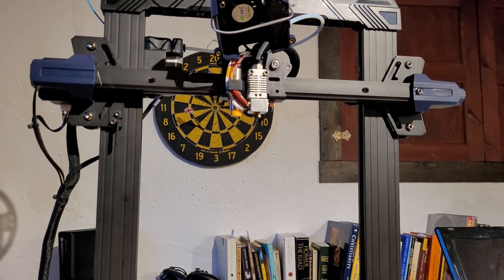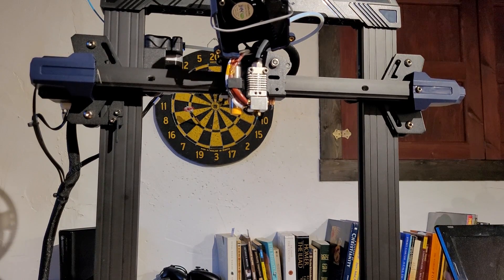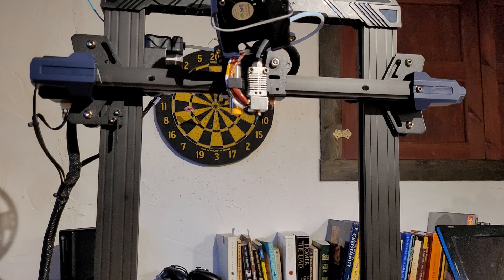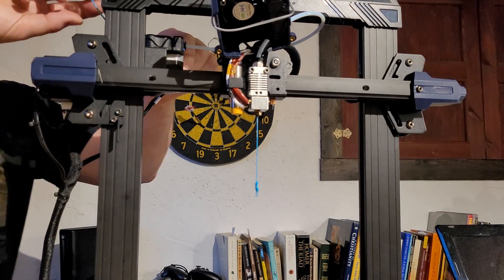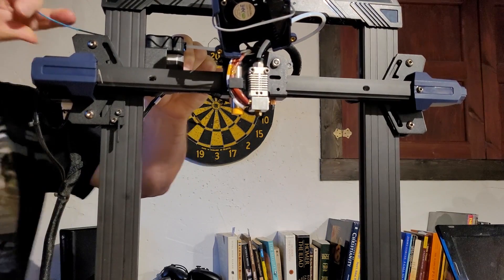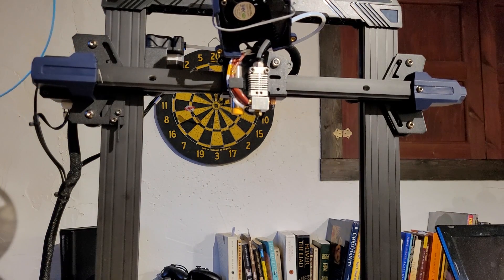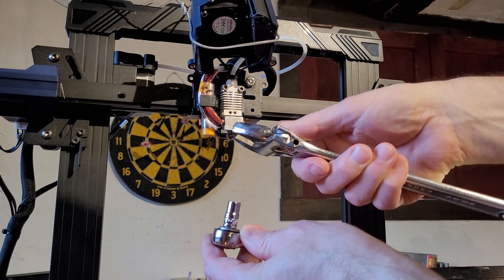I'm going to try a method to take the filament out of the nozzle, because ideally we want it empty. I'll use Prepare mode to load filament, then go around the back, pinch open the drive so it won't drive, push the filament through, and then do a quick retraction — the goal is to have as little melted filament in the nozzle area as possible. I've pushed and pulled out the filament to empty the nozzle. It's now up to temperature at 200 degrees.